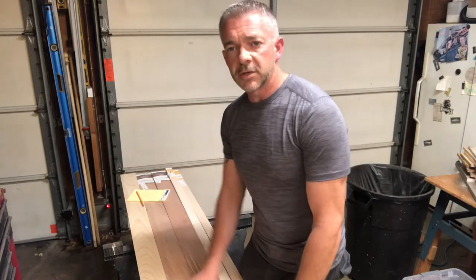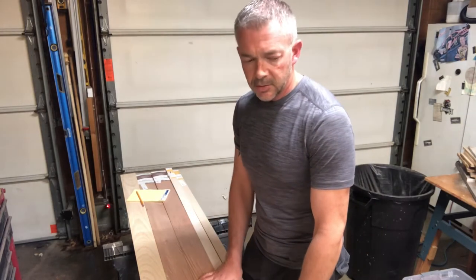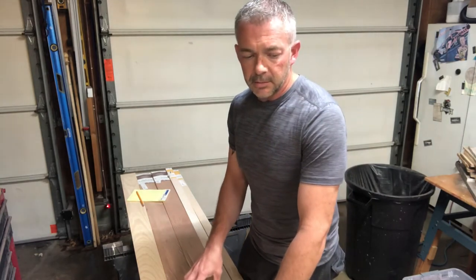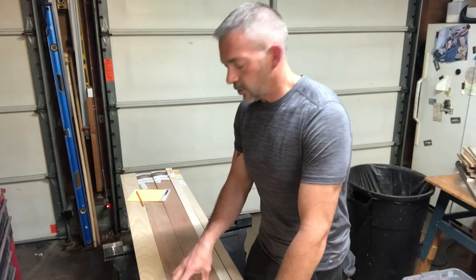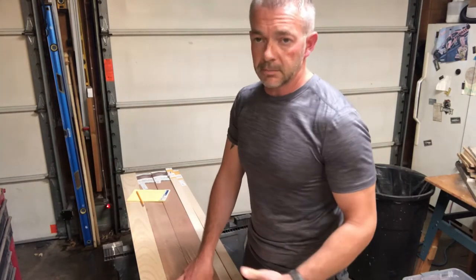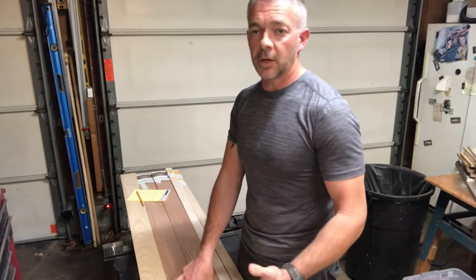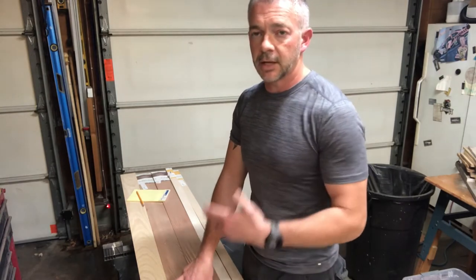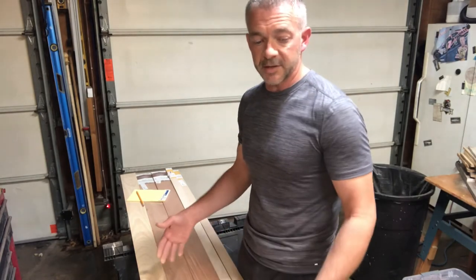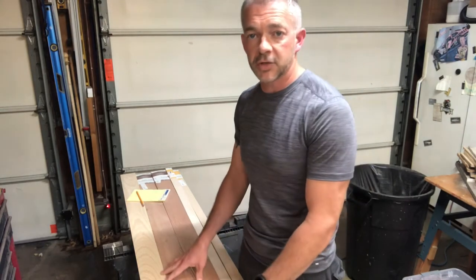Do some research on what boards you'd like to use. I always recommend hardwoods that are not open grain, so they don't have the pores for food particles and things like that to get stuck in. With a charcuterie board, it's not going to be a big deal — you're not cutting on it. You can jump into some other woods as well with a charcuterie board because as long as you're not cutting on it, you won't have to worry about knifing into it. If it's just for decoration, don't worry about your softer woods.